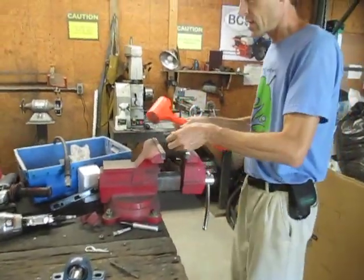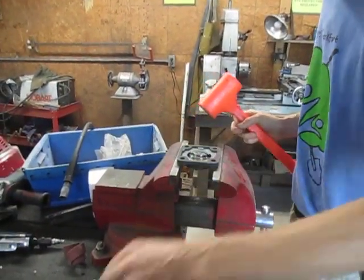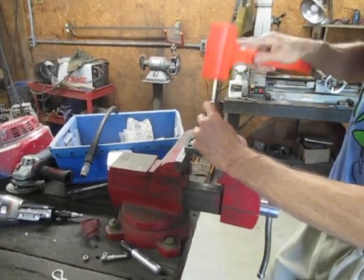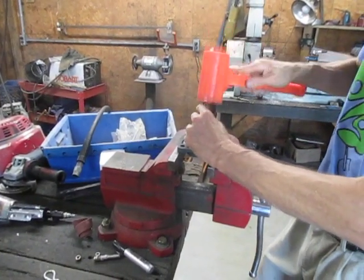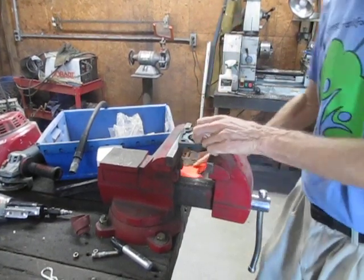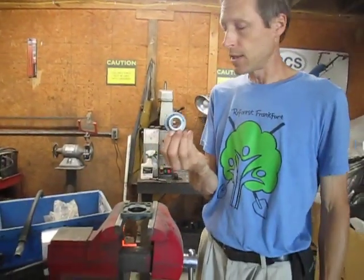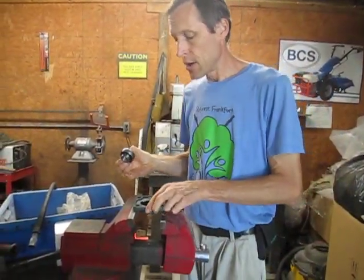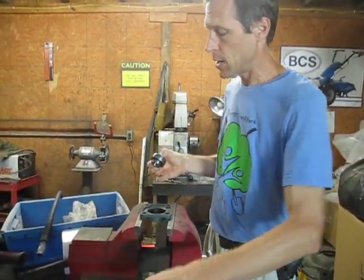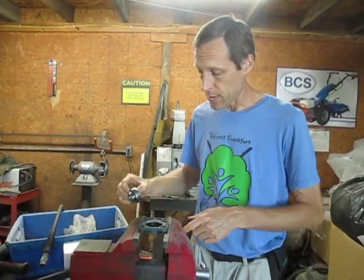You can set these things on a vise — just open the vise up so you have somewhere to knock down into, so that bearing can swing sideways and go below the surface of whatever you're hitting against. And there it is — there's your bearing insert. Those are available separately from the outer housing. You can buy them as an assembly, but depending on what bearing it is, sometimes getting the insert is a lot cheaper than having to buy the whole housing.